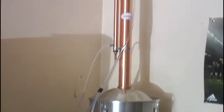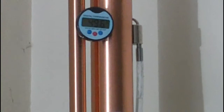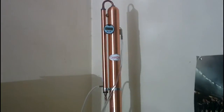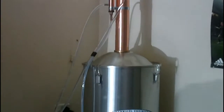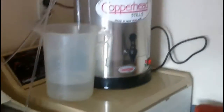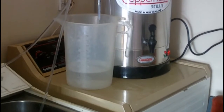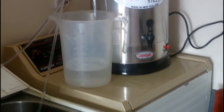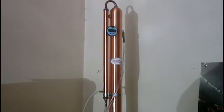And that's the still in operation. We're running at 49.6 degrees — the range is 46 to 52, with ideal being 49, so I'm pretty damn close, only 0.5 of a degree warmer than perfect. We've already got just under a litre and a half, and the still has been running from plug-in about an hour and fifteen minutes. I've already got a litre and a half out of it — it is running like a frickin' champion.